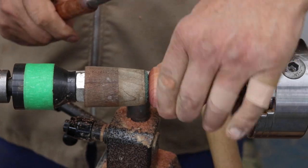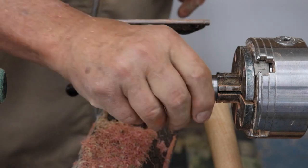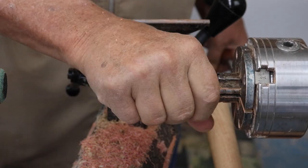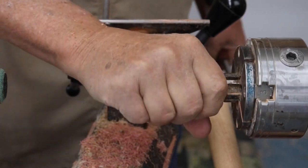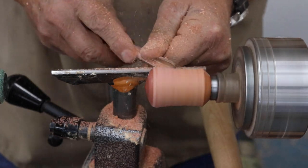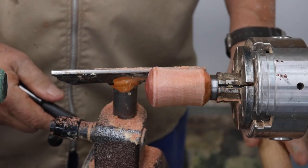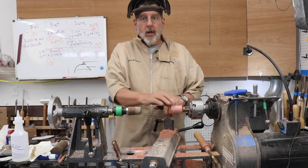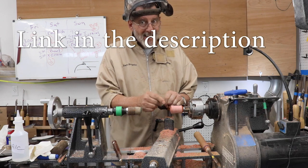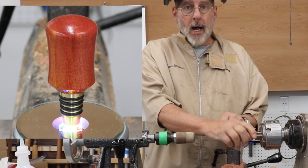I put a sharpen on my little gouge here. Keep in mind that this bottle stopper is not for my hand — it's for my wife. I think rounding this over right here is a good idea; I don't want anything sharp right there. That looks pretty good. I am all ready to sand and apply a finish. If you want to see more on the finishing aspect of these projects, you can go to the sister video for more detail on sanding and applying a friction polish. The turning on this is pretty much completed, so I'll show you the finished bottle stopper momentarily.